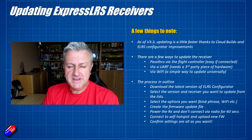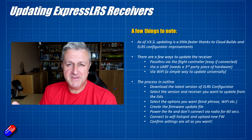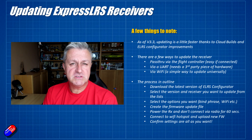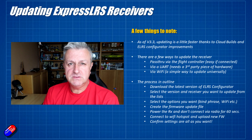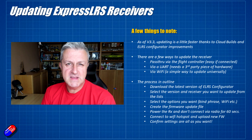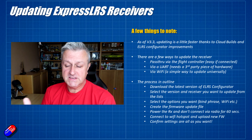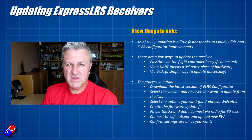However, pass-through only works if it's connected to a flight controller that's configured correctly, so unfortunately it isn't bulletproof. If you're connecting via SBUS or a PWM connection, that isn't going to work for you. That said, pass-through is one of the easiest ways to unbrick an ExpressLRS receiver if something goes wrong with an update. There is a little boot button that will put it into bootloader mode, and then if it's connected to the flight controller, the flight controller will act as the connection.